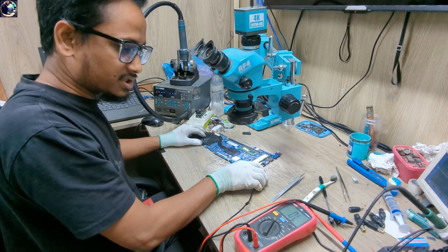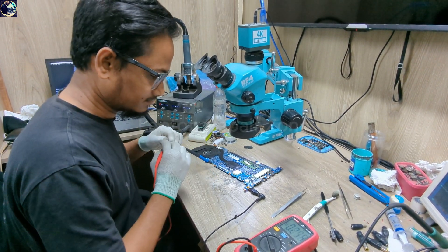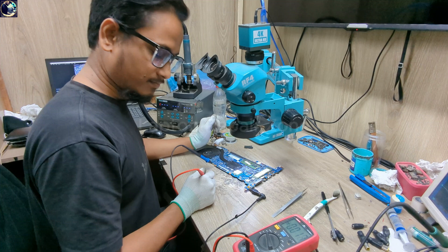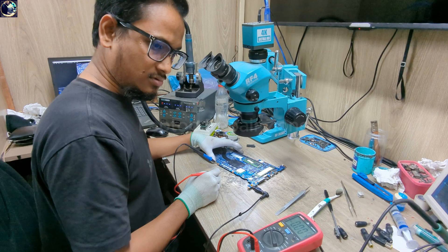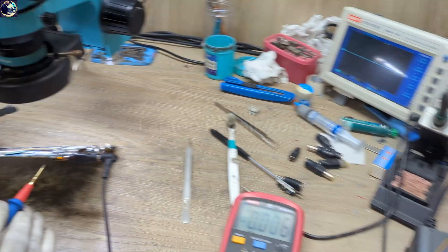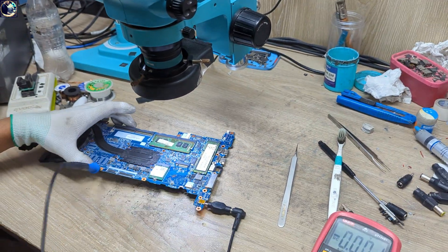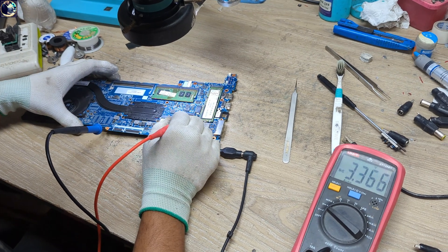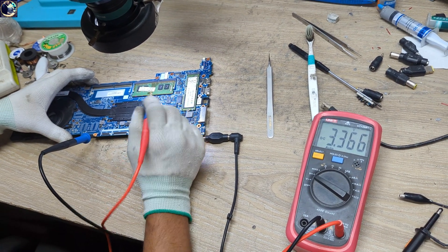Let's plug in again — and it's turned on! Look at my power supply — it's turned on and the blinking is off. We can see the orange LED is glowing. Let's check the voltage — now we have 3.3 volt present on the secondary side.